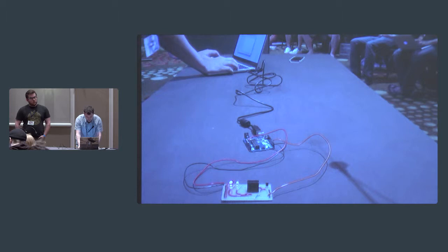And so if I put in a string like decrease, so DEC for decrease, you will see it's now, this is the serial monitor of Arduino, which I'm sure a lot of you have used, if not for getting information, but you can also give it information. So you see every time I type in the DEC string, it'll decrease. And it will start blinking faster. And so you can use this to do anything, right? You can use this to communicate with your code in any way. And like I said, there's also ways that you can take straight things from the keyboard. And then because I'm reckless, we will take it down to a 0-second delay. I'm excited. There we go. And you can stop now. Yeah, okay. For the most part, that's generally it.